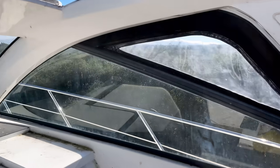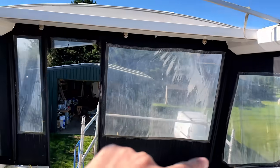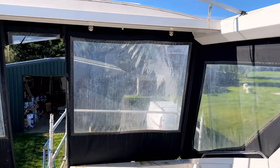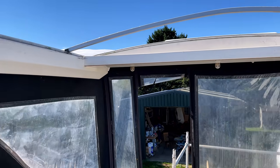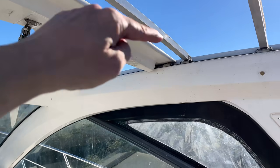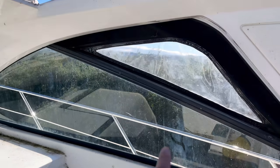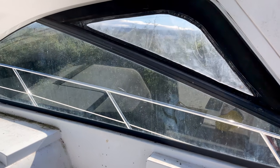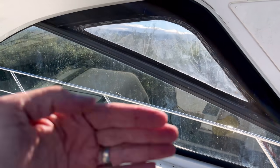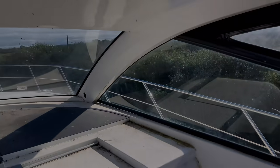Another one to go here. And then we've got one to go on the back. And on this side as well. And then we can basically build a frame or roof structure across the top here. And that'll actually go out over the side of the boat, and we'll probably finish it level with those rails there, and then we'll be able to just wrap straight down, and that'll give us that nice safe walkway that we need. So let's get those bits of timber cut.